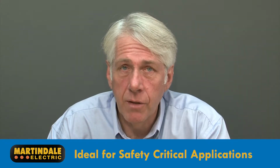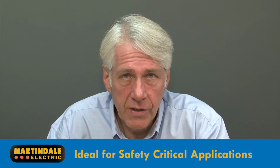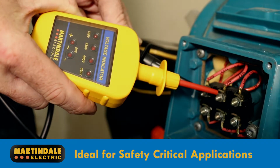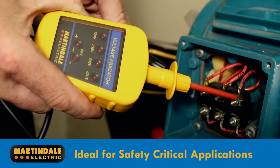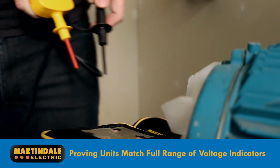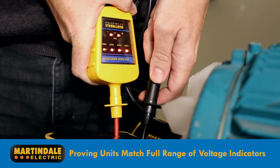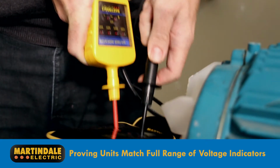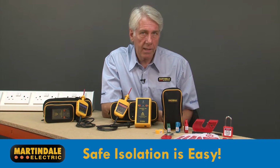The VI series of voltage indicators are ideal for safety critical applications due to their simple design. They're safe because they're simple, with no switches or ranges to select and no batteries required. The proving units match the full voltage range of the voltage indicators to ensure they're working correctly. With these kits, safe isolation is easy.